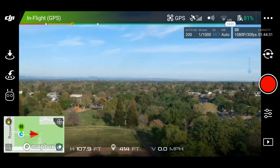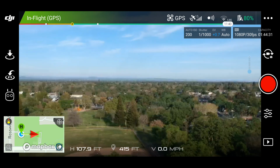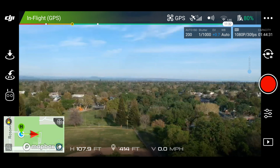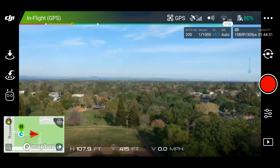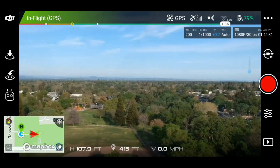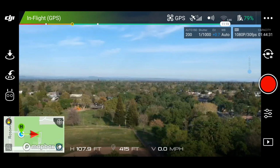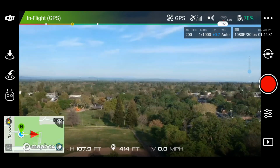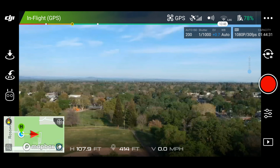I'm gonna point the Yagi straight up, you see, and we lose signal. Down again at about 20 degree elevation, we got two bars. Now if I point the Yagi's down towards the ground, yeah, lose. Okay, back up again, about 20 degree elevation. There we go.